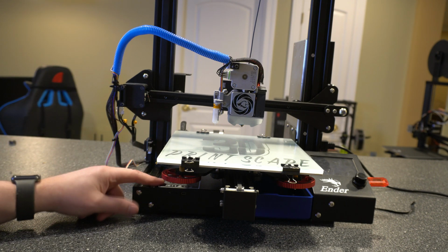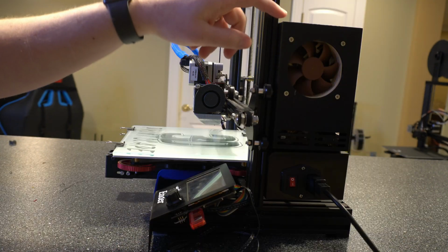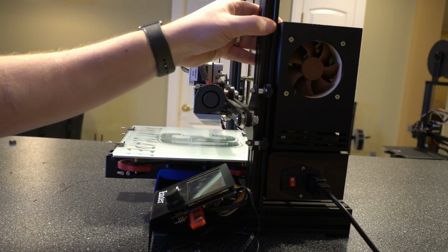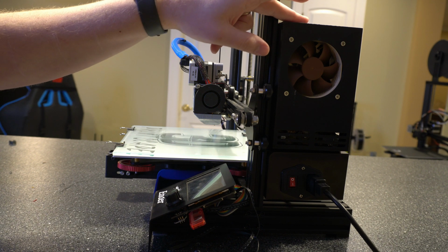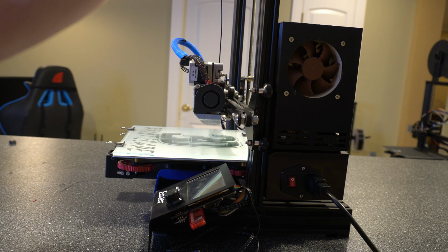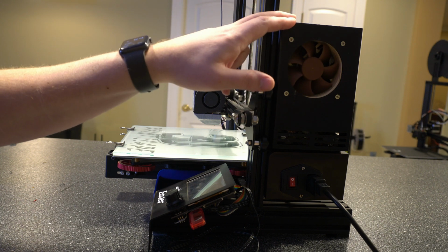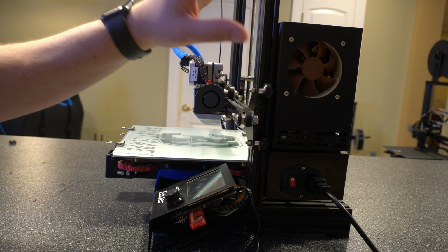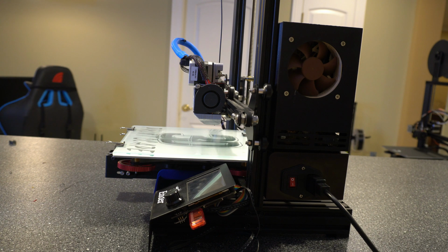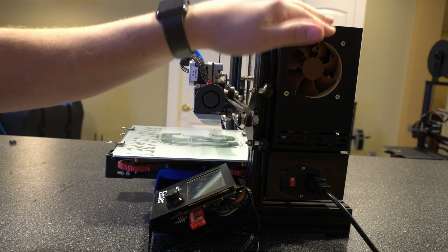Then the other thing, after I upgraded to the silent board, let me turn this real quick. The biggest issue I had was the noise from the actual power supply. It's just a small fan mounted directly on the metal, and it gets loud. So switching to this one, it reduced the overall noise by, I think it was like 8 or 9 decibels, which is pretty substantial. And it wasn't too difficult. I think the print took like 8 or 9 hours, and then your fan is somewhere in the ballpark of like 15 bucks. Again, I did a video covering all of this. I'll link to that in the description. But if you're looking to reduce the noise output, I would really focus on the silent board and the power supply fan upgrade.